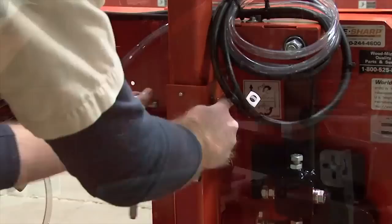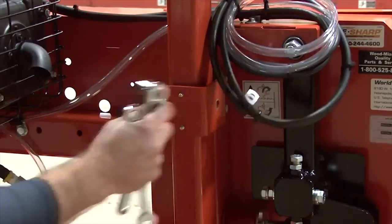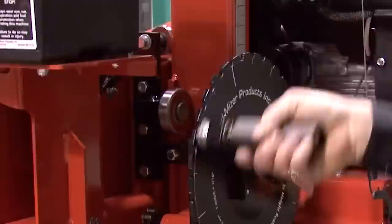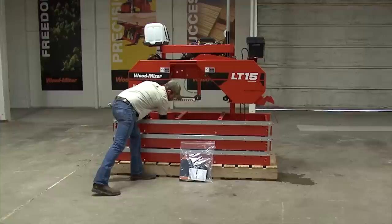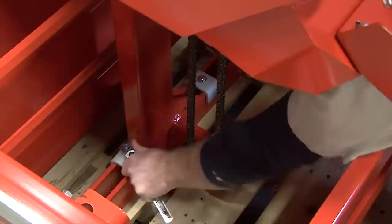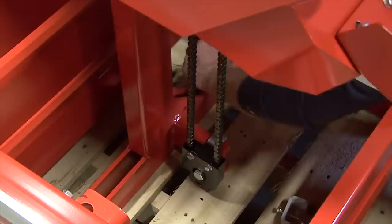On the opposite side of the head mast assembly, remove the bolt that is securing the head into place. Squeeze the now-released lever and rotate it clockwise to raise the head all the way up. Ensure that the handle firmly locks into place before continuing. At this time, remove all the boxes containing the mill hardware and blade and set these aside for later use. Now remove the two bolts and shipping brackets holding the head to the pallet on the hand crank side of the mill, making sure to remove both bolts and brackets.